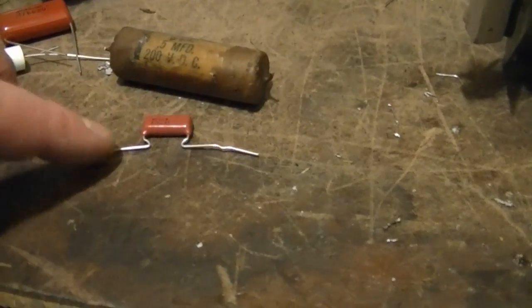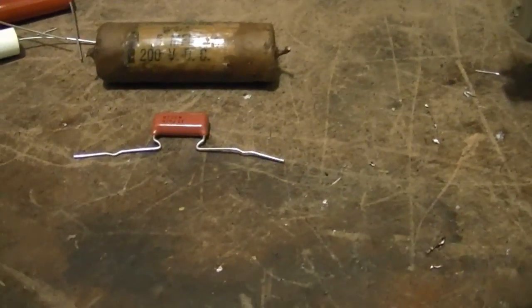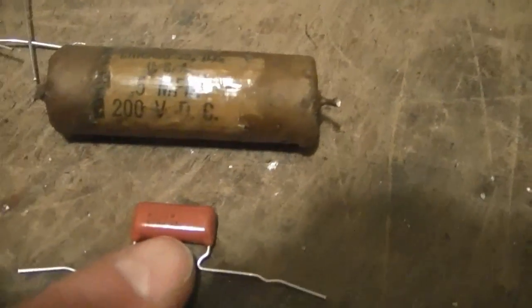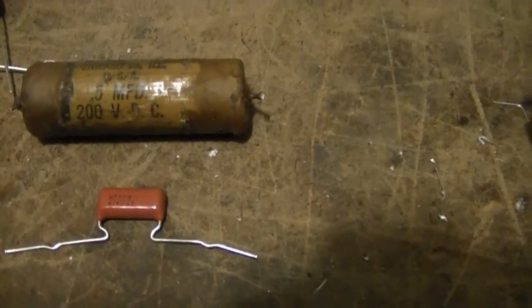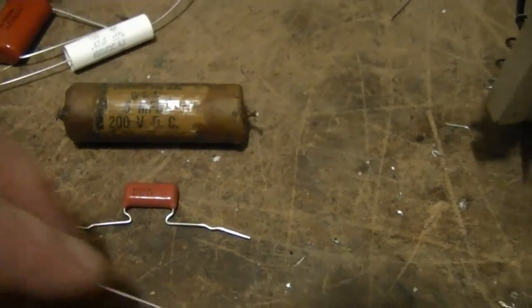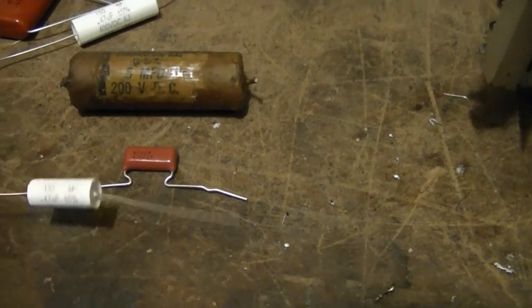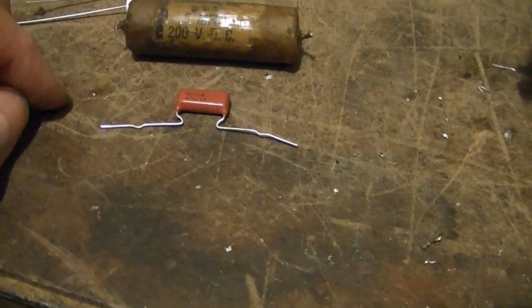So they're really making some progress with these. That's a Panasonic. It's a new line that Mouser just started carrying. I just wish they had the voltage rating on it. It turns out if you look up the data sheet, it's the 2W. The 2W means 450. Go figure. It has no connection to me, but internally that code of 2W means 450 volts. So, although I could go with this, these are kind of expensive, so I like to reserve these for restuffing on a more valuable set. So I'm going to go with that guy.